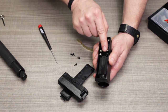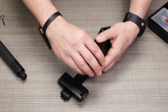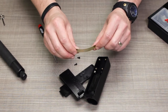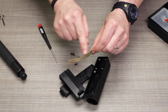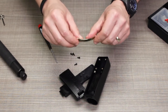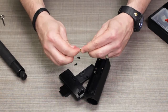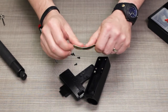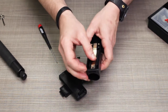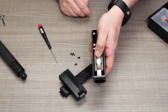You'll also see two screws which we'll talk about more later — there's a lockout screw and a spare. To adjust the retention of the baton inside the scabbard, you need to increase or decrease the degree to which the retention clip pushes out into the scabbard housing. If you want to increase the retention, simply bend a deeper curve into the clip. If you want to decrease it, flatten it out. I'm going to put a pretty deep curve into it and then put it back in place, making sure to locate the registration pin in the hole.